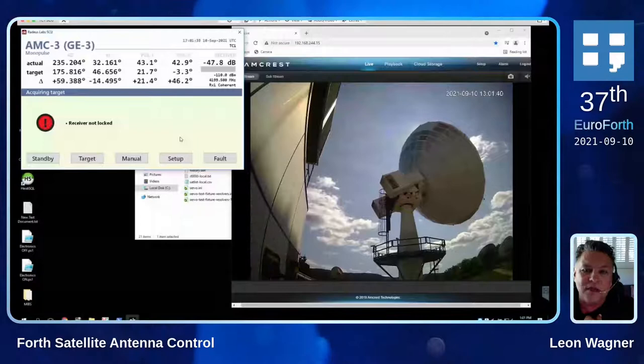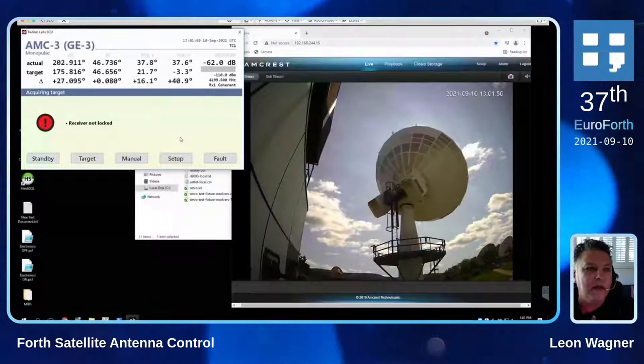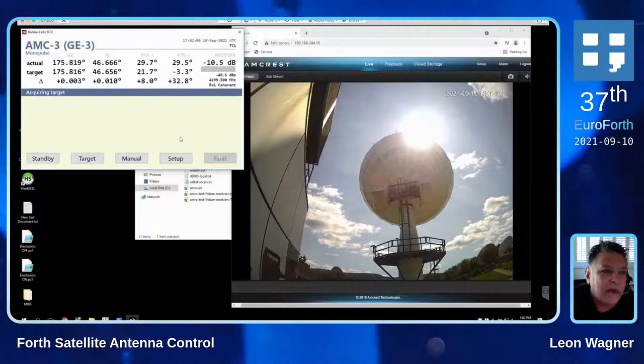Boom. This is a fast antenna. And when you think of how big that is, it's really impressive. This thing can move at just over three degrees per second in both azimuth and elevation, so it's making all those position changes. The two columns — azimuth and elevation — are showing you the actual measured position from some encoders. We're using optical encoders of the azimuth and elevation axes.